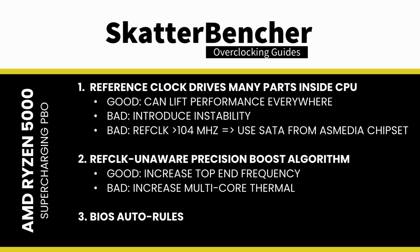Third, just like any motherboard, the B550 Aorus Master has a lot of BIOS auto rules to help with easy overclocking. However, the same auto rules that help make manual overclocking amazingly easy can sometimes make overclocking with Precision Boost Overdrive trickier. When increasing the reference clock to over 104 MHz, the auto rules of the BIOS force the CPU into OC mode and thus have all Precision Boost functionality disabled. So you'll end up with a fixed ratio in the operating system. There are no options in the BIOS to work around this issue, so unfortunately 104 MHz is the maximum base clock frequency for our supercharged Precision Boost Overdrive strategy.